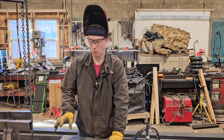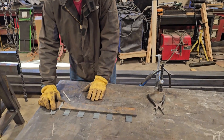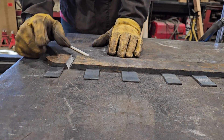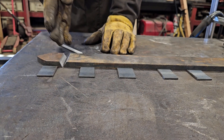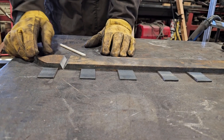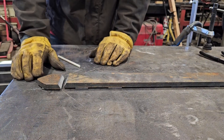In this video I'm going to show you how to weld a half inch butt weld. I have a half inch mild carbon steel. We've beveled it so it's a dual bevel groove — 30 degrees, so 60 degree included. We have some spacers here. We're going to put them on the spacers so that we don't weld to our table.